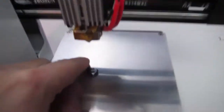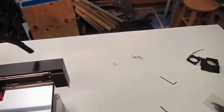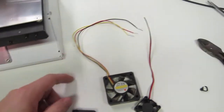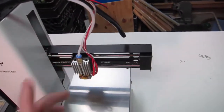Let me show you what I've done so far. First, I cut off the zip tie holding the wire on and moved it out of the way. Then I removed the plastic sheathing up to about here and cut the wire. I unscrewed the fan from the shroud — you can see the difference in size between the two fans. Next I'll take some wire strippers, strip the wires back, and solder the red and black onto there. I already tested this with a 9-volt battery so I know it's just the red and black wires. I'll wind up or cut the yellow wire, then screw the two printed parts on with the existing screws, use two more nuts and bolts to secure it, twist the wire back up, zip tie it in place, and it should be good to go.